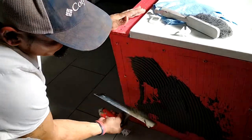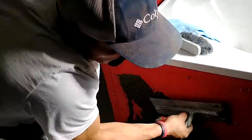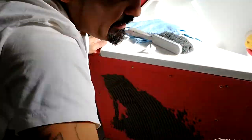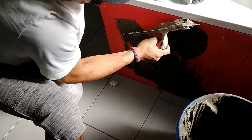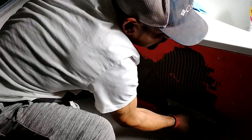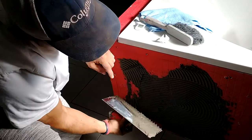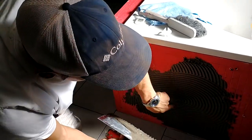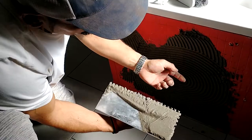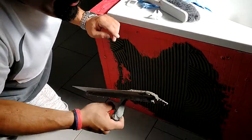Because you'll make a mess when you're going up the walls. And boom, you're going to splash that, come up. You always want to direct — roll with you. You don't want to swirl. If you go swirl like this, this is not catching right; this is not the proper way to do it. You want your teeth to spit out mud, not take away mud.